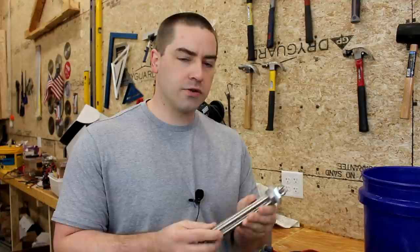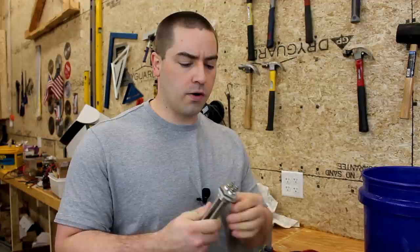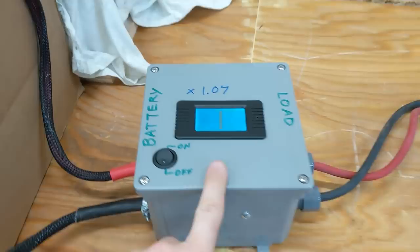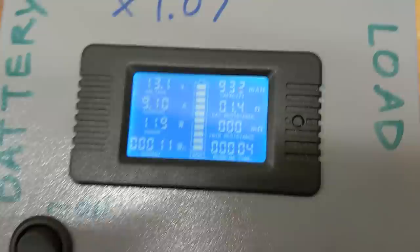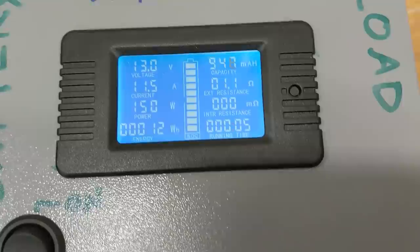I wanted to make sure my multimeter wasn't broken, or I was reading the ohms wrong, or maybe doing the math wrong altogether. So I did hook it up to a bucket and the battery to see what our actual wattage is. Remember, this was advertised as 800 watts. Here's our bucket of water with the element inside, hooked up to our meter and a pair of powerful 12 volt batteries. You can see 150 watts — that is only one-fifth of what we should be getting.